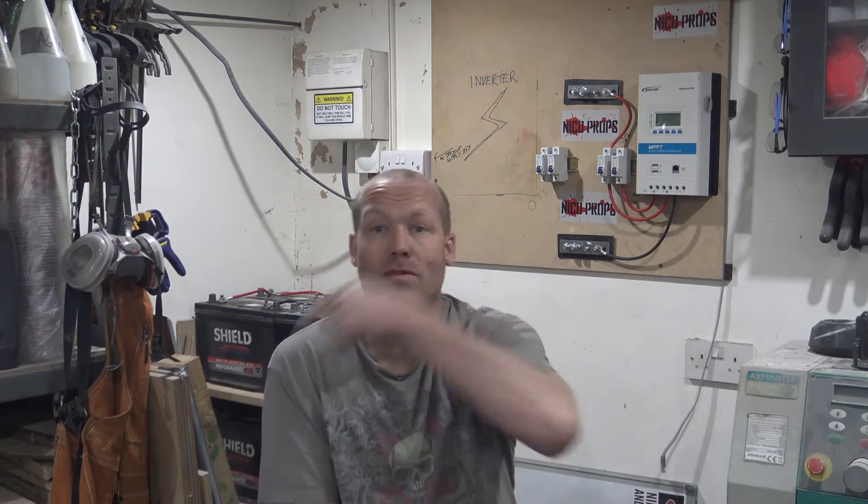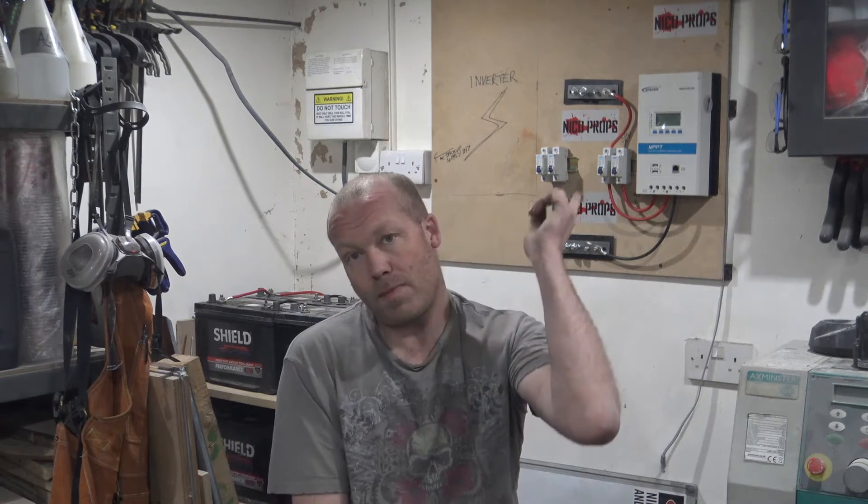I've built a rack behind me so that they're much closer. All part of the learning experience — while I was googling and working out materials and working out what cable to attach to the battery pack, when I had it down there I realized that I have to account for the resistance of the cable itself over the distance from this panel down to where the batteries were and back again.